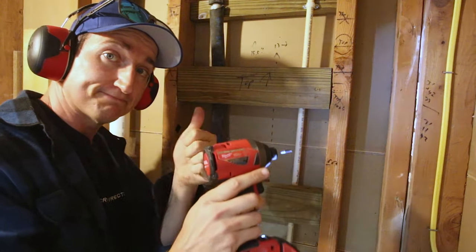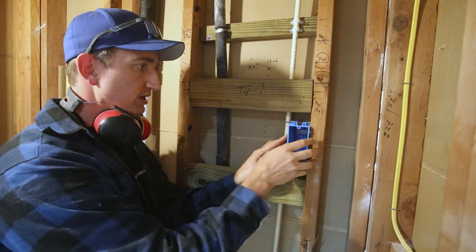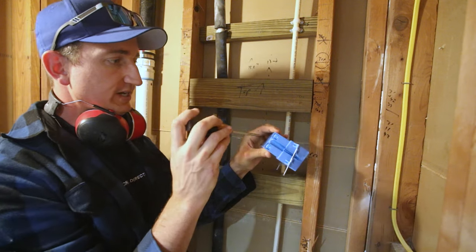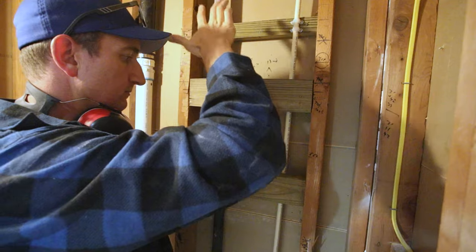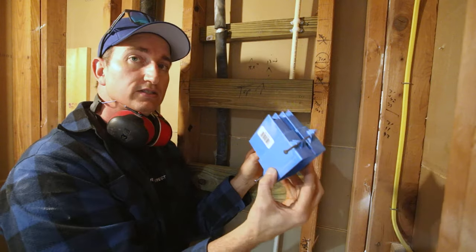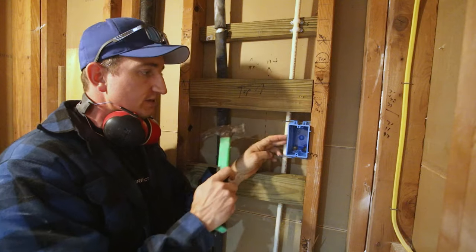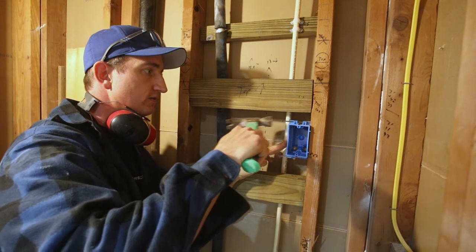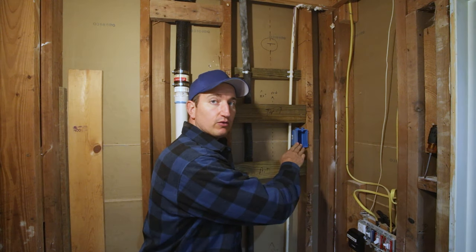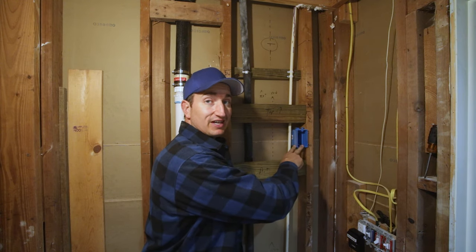Got to love impact drivers. This is still my clearance space for the outlet, so I'm going to put the outlet box right here. This is just a normal receptacle box — there are little tabs I want to pop a hole in so I can feed my wire when I'm ready. I put the receptacle box up against the stud; these are nice because they come with the nails already on, so I just tap it into the stud.